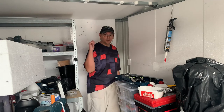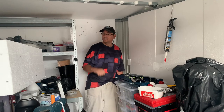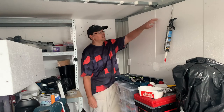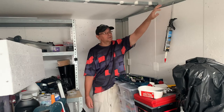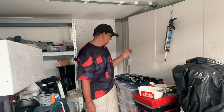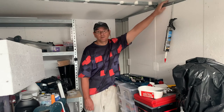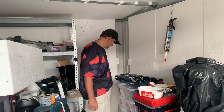And then I decided to put 5 centimeter insulation on the back and 3 centimeters on the wall because it fits nicely into the recess here. I'm going to actually put up some extra holding on the top on this edge here, so hold it against the wall, once I've got all of it. And then I'm probably going to put some extra insulation up in these gaps where there's no insulation.